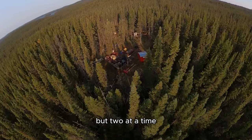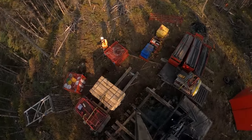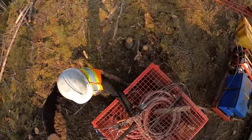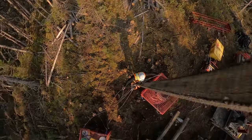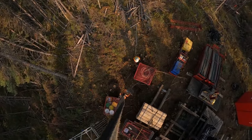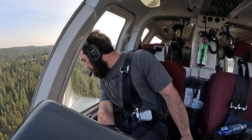Baskets again, but two at a time. Flying two loads simultaneously together can generally be uncomfortable. But these baskets are the same shape, the same size, the four pointers are the same length, so it'll fly as if it was just one load. As I start to lift it up, they're going to come crashing together. It wasn't as dramatic as I thought it was going to be.